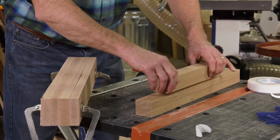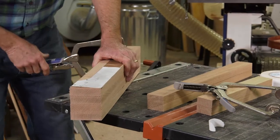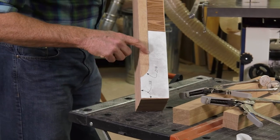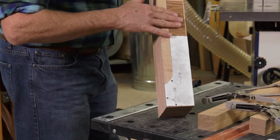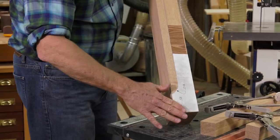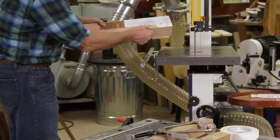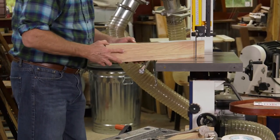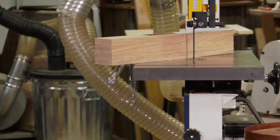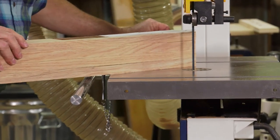The first step on this one — it's ready now — is to lay in a two-inch radius right there. I have that on removable contact paper, which makes it easy to reuse the jig. Now I'm going to cut out this graceful sweep one inch in along this leg. I need to get hearing protection, and we'll make those cuts with a quarter-inch six-tooth blade.